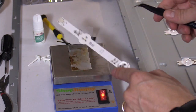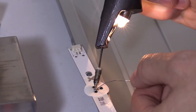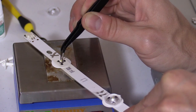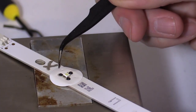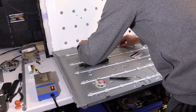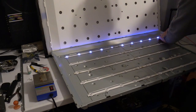Next we're going to work on the second one. Just let it heat up for a minute or so, use the needle-nose tweezers to remove it, then prep the pads once again — there's a fat pad and a skinny pad. If you bridge the connections you'll probably damage the LED, so at that point you'd have to remove it and put a new LED. Let it settle in place and test it to make sure the connection isn't bridged — I put a bit too much solder on that, but it is good.